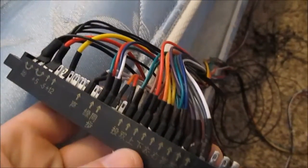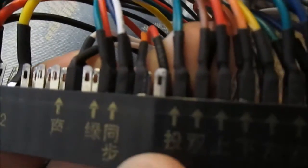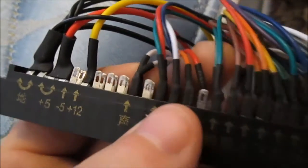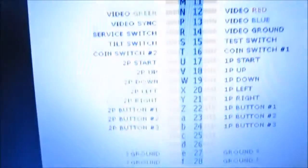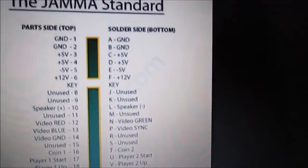If you just look at this wire it's like — wow, that's a rat's nest. It is, but you just start here and do one at a time. Hook up your stuff one at a time and go down the line — it'll start to make sense. Starting here, I think pin sixteen is for your coins. One, two, three, four, five, six, seven, eight, nine, ten, eleven, twelve, thirteen, fourteen, fifteen, sixteen — the two greens are your coin inputs. This layout is actually backwards from the other pin, but they tell you: solder side, part side.